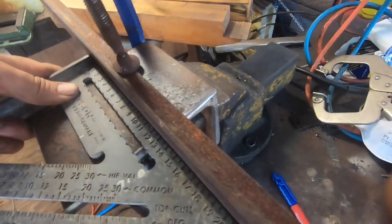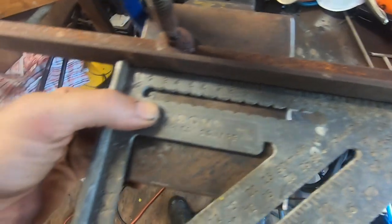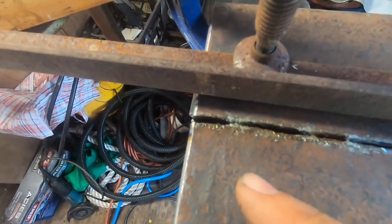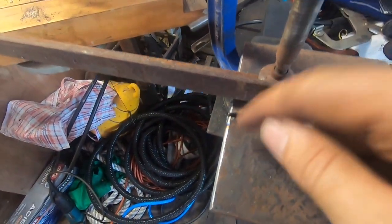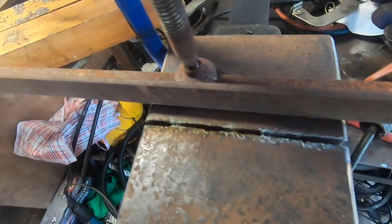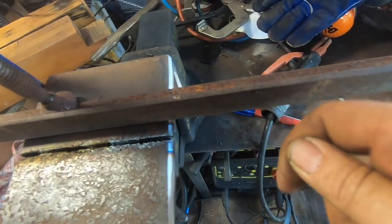This next one doesn't have to come out anywhere near as far. Just clamped a bit of angle iron on here with the speed square, and then we'll run the plasma cutter across it. I think I'm getting a bit better at the plasma cutting. We've got this set at kind of 42 amps because this is quite thick. You can see sparks coming out the bottom side, and when they stop you're obviously not all the way through, so I hold in position until I see the sparks coming again and then move on. I've also started not letting go of the trigger when I get to the end of the cut - I get past it and let the pilot arc go for a little bit, to see if that stops the tip blocking up.